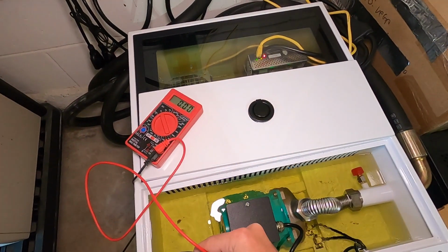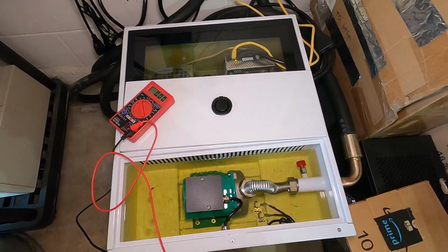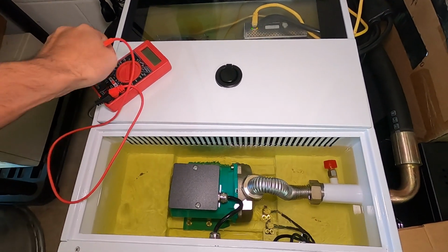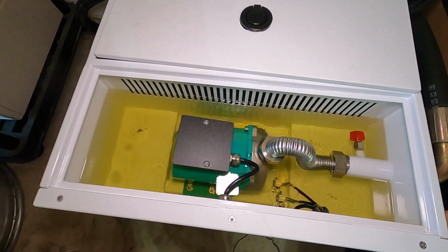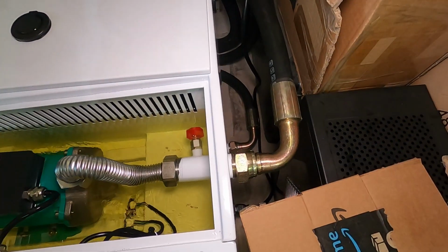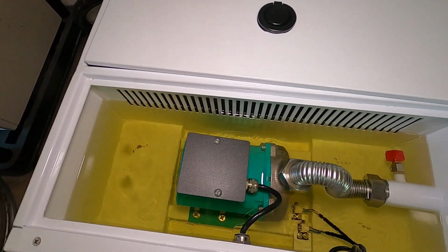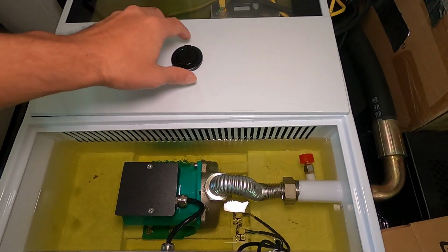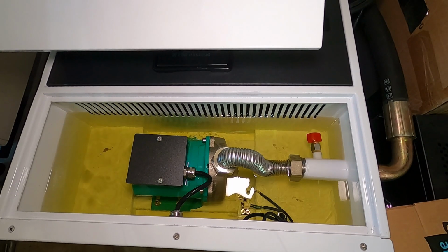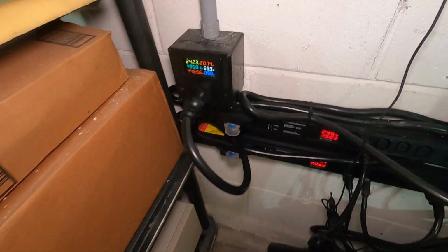My machines have been running just fine, but the discoloration does bother me a little bit. I think our best bet is to let it run, but monitor it and maintain the current situation. Basically, keep an eye on this coloration. If this color turns any more yellow, we need to swap out those fittings, see if they can get me some brass straights, and just spend the extra 250 bucks that I spent on brass fittings, and then just deal with the yellow coloration. Or leave it like this, right? If it's not hurting anything, the machines are running cool, everything's running great, then we'll be just fine.